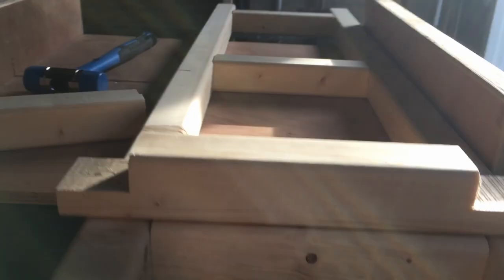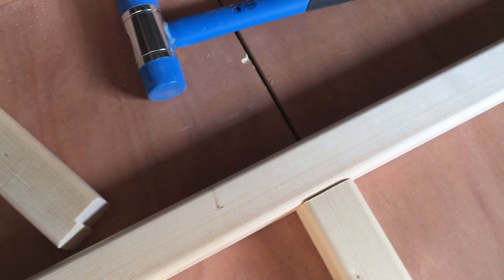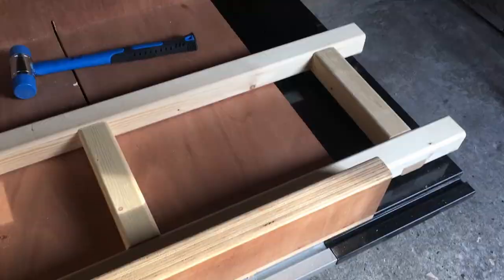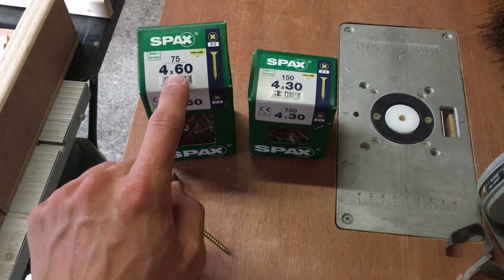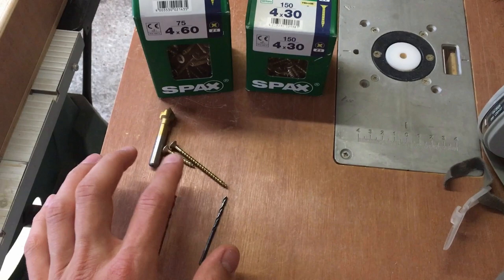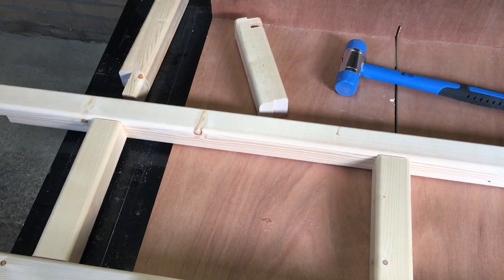The angles are 90 degrees in all corners — I've checked all of them. I'm pretty proud of the work. For this build my strategy uses two types of screws: 60 millimeter length for most connections and shorter ones for the top. I'll use a 2.5 mm diameter drill bit first to check, then a countersunk bit to create the countersunk feature.